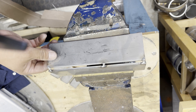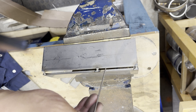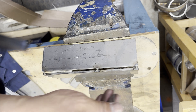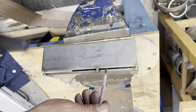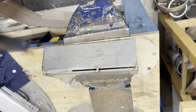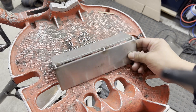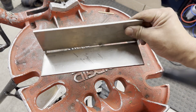Then vice grip two stainless steel plates, giving a gap between 3/32 and 1/8. After confirming that the open root gap is okay, give a tack to hold the two plates. The practice coupon is ready — it is simple and easy. 3/32 wire goes into the gap, but not 1/8, so the gap is between 3/32 and 1/8. This is my favorite gap, but don't be too picky — a little bit narrow or a little bit wider doesn't matter.